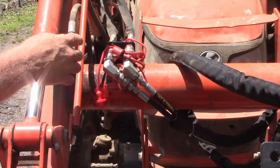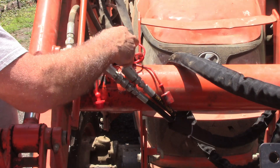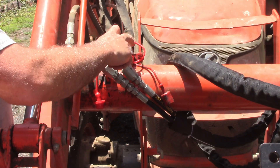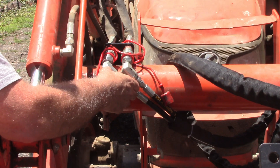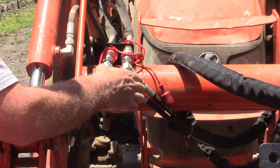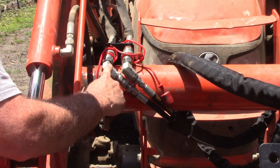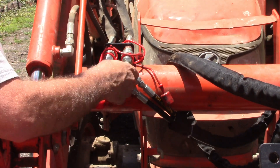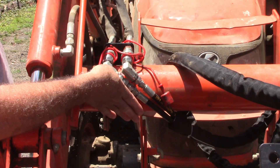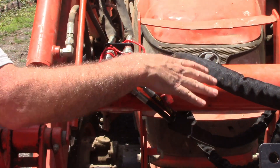Here's where my third arm hydraulics come out. Of course, being a third arm, it's just a solenoid valve — so it's off and on — that's why you need the restrictor, because you can't ease a valve like that. The restrictor is right here. I put 90-degree angle fittings on here because without them the hoses and couplers were sticking way out, and then the hoses wanted to continue out further.